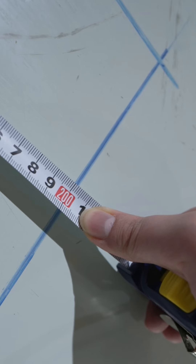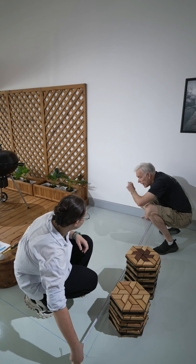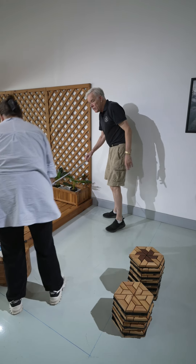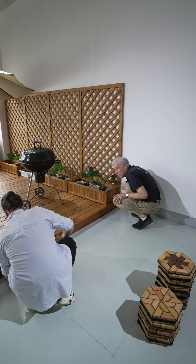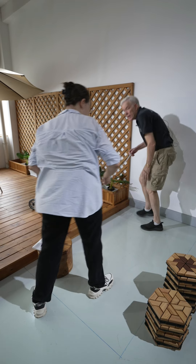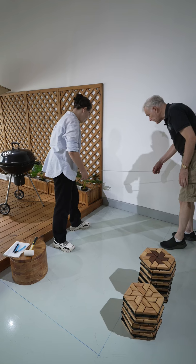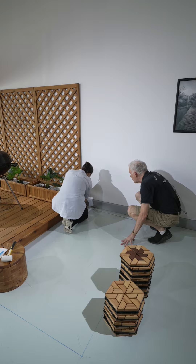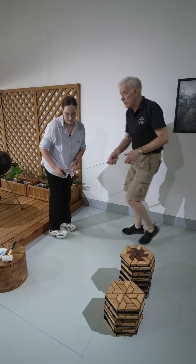Often, places are not square even though you think your house is lovely. A lot of things are not exactly square. So you really should measure the two corners. You wouldn't measure in the middle really — or you could — but just to make sure you've got two metres. This is a square because we did it this morning and we know, so here we've got 1.2 and 1.2 down there because we already know that.